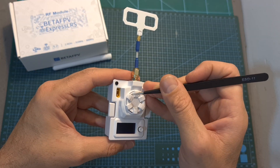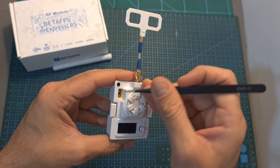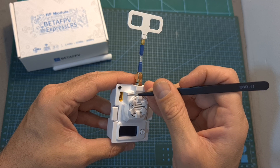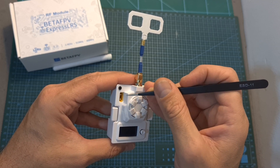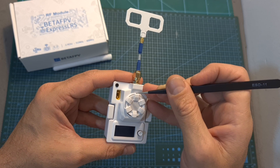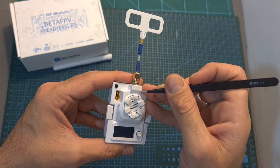In order to preserve the battery life of your radio controller, the Micro TX module can be powered externally using this XT30 battery connector. Pay attention that the supported input voltage is between 5 to 12 volts, so according to BetaFPV you should not use 3S batteries, as if the voltage exceeds 12 volts it is going to damage the module. In addition, the module features a built-in fan which will automatically turn on once the output power is set to 250 mW or above.